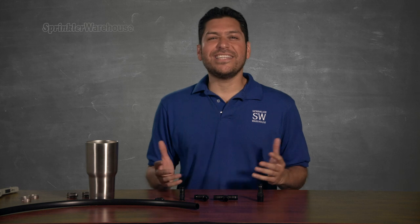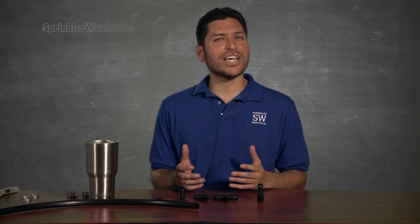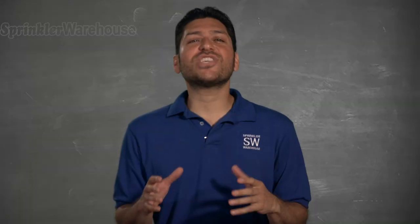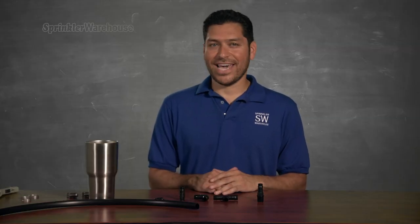What's this OD/ID stuff? Well, if you're buying half inch tubing, it isn't just half inch — it has a few different sizes, all considered half inch. OD is the outer diameter: .67, .70, .710. And then there's inner diameter: .57, .600, .58, .615. Inside diameter depends on the thickness of the material. For barbed fittings, you'll need the ID or inner diameter, and for compression fittings, you will need to know the OD or outer diameter. If you're in doubt of what size you're working with, most manufacturers print the specs on the side of the tubing.